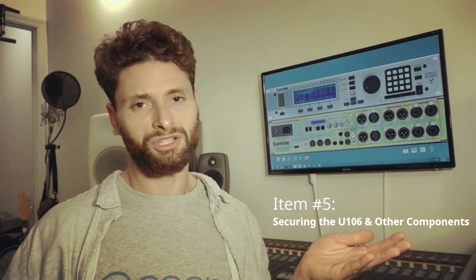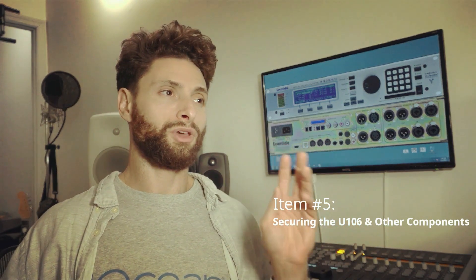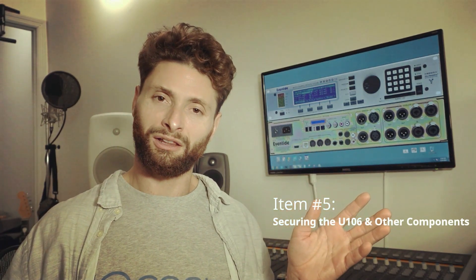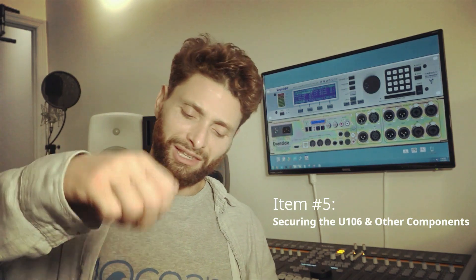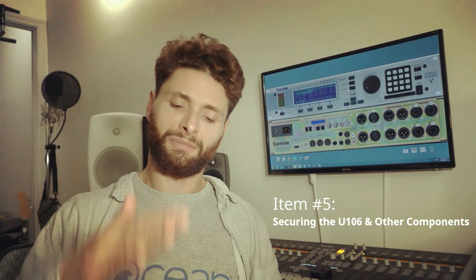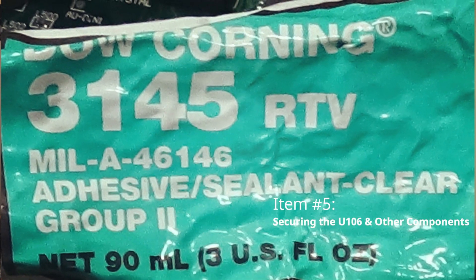While you're in there, it helps to make sure that all the socketed chips are seated well. If it's been a long time since you've had this machine, or maybe you have an early version that's been sitting a while, if you've got a ROM puller, just pull them up, a little shot of DeoxIT Gold in there, use a blower — I like a blower because I don't want it to be all soupy in there. Put the DeoxIT and do the blower so that it leaves a nice thin film. Pop the chips back in, secure other ribbons in place with the Dow Corning RTV sealant.